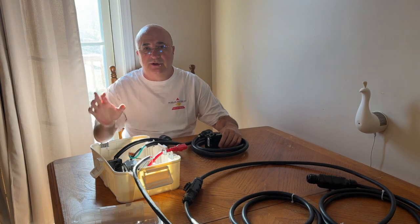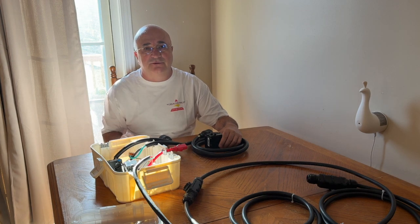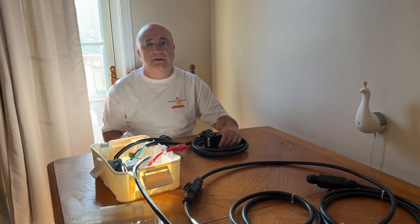In your main service panel, you should always do this with a dedicated circuit. Never connect solar to some random receptacle in your house, even if it's a 240 volt receptacle, because when you do that it is no longer protected by the breaker at the panel, and it can overload the wires, it can overload the receptacles and can cause a fire. So don't do that. Word of warning.